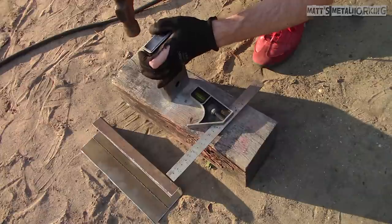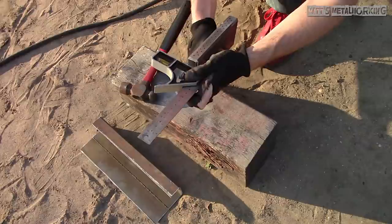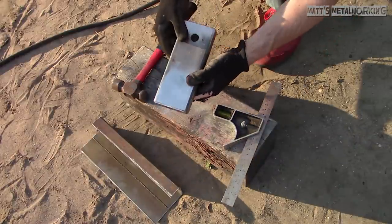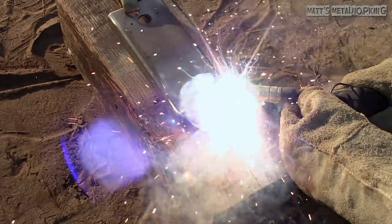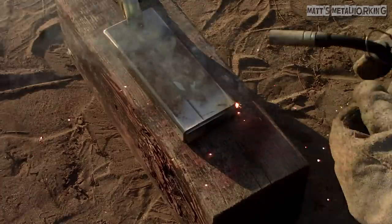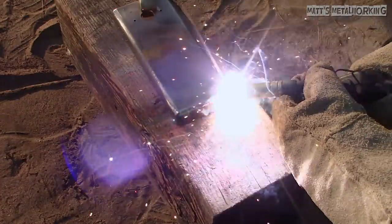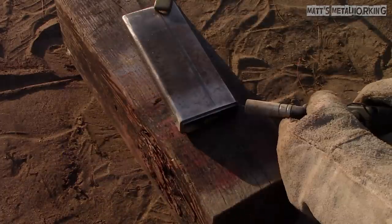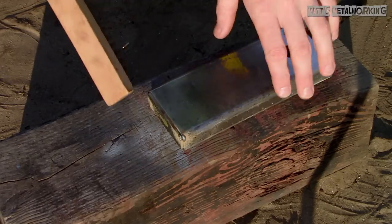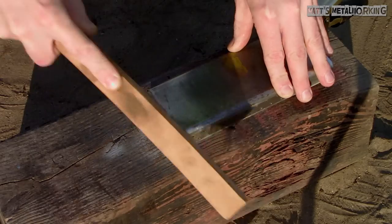The end caps get installed — they fit reasonably tight so they won't move while welding and everything is squared up accordingly. Tack welding the caps in place on opposite ends. During welding, due to excessive heat, parts can pull or warp causing distortion in your workpiece, so tack welds help keep those parts in place. While this isn't overly critical on a barbecue burner it's still good practice and it keeps your project looking clean regardless of what it is.